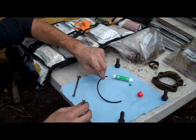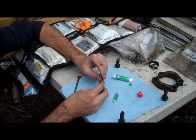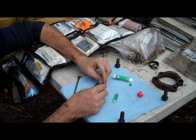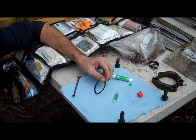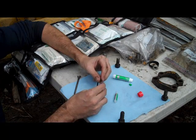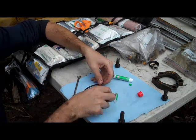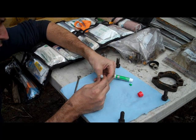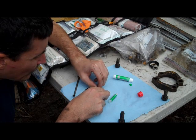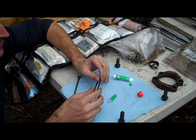Here's a trade secret for you. If you ever have an O-ring that is broken — and this is kind of a non-critical O-ring right here, it'll be easy to get to if it does leak — it is very common in the industry for people to make their own O-rings. With superglue you can connect them. So if you have an O-ring that's not quite the right fit, or you need to make one work in a pinch, you can take superglue and glue them. I lucked out because I had my first aid kit with some crazy glue, and I took this O-ring out and it was broken. When you connect them, you want to cut them at a 45-degree angle so they lay on top of each other — that's best. But you can go butt-to-butt like this one here, since it's already cut and making it any shorter means it won't fit. Put some glue on there, make sure they're stuck good, and it works like a charm.